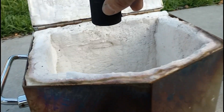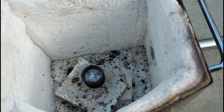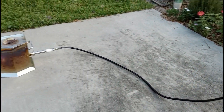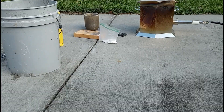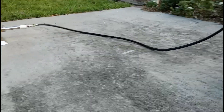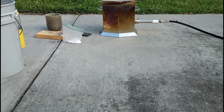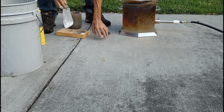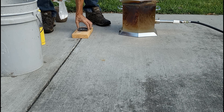You get to take a look inside the cold furnace while I load the crucible in. It gets used an awful lot. The crucible's sitting on top of two aluminum oxide blocks. I'll tell you a little bit about my setup here. I always keep the gas tank on the right-hand side, because that's where the burner comes into the furnace. Everything that could get hot goes to the left of the furnace. I always keep my favorite gray five-gallon bucket to the left-hand side, full of water for quenching and for emergencies. The gas hose is the reason why all the hot stuff goes to the left.